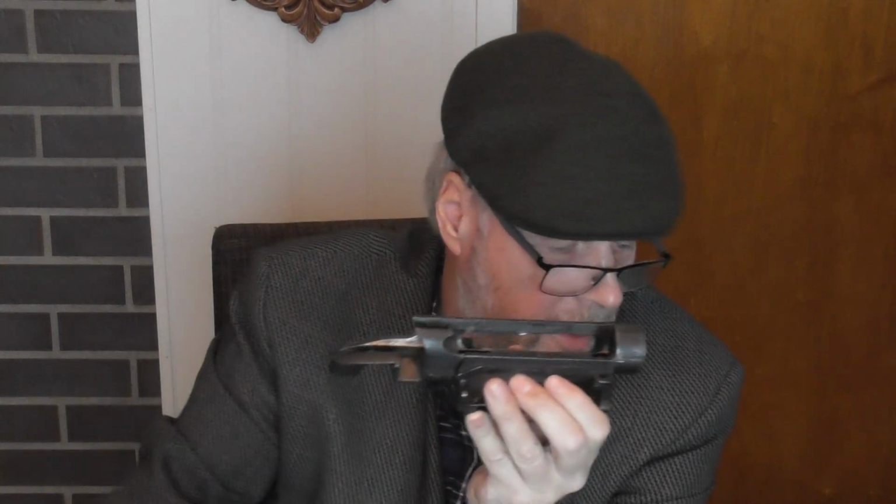And usually you can kind of get a bulge or dent underneath here, and then you can use a Dremel tool with a rounded tip and these diamonds on it, and you can grind away on the inside here. Basically do the same thing as you did with this Bosch blue drill bit. You got to get rid of that hardened surface, and then you finish your drilling, and then you can do the tapping.